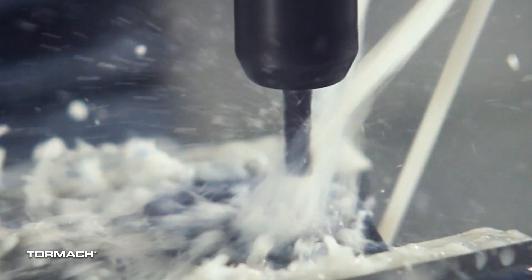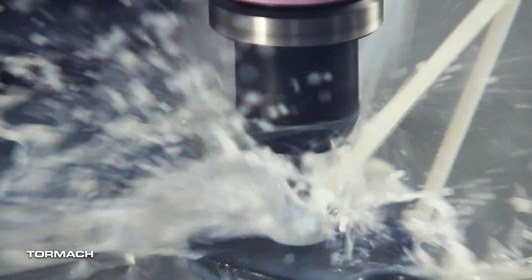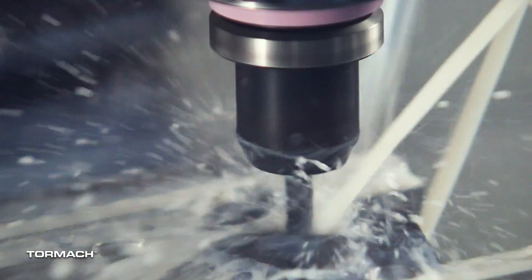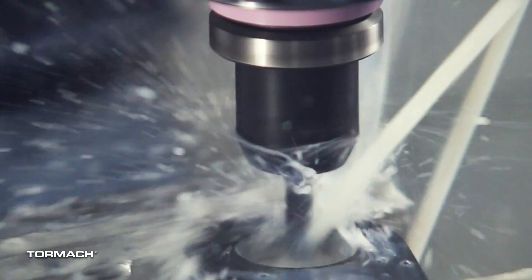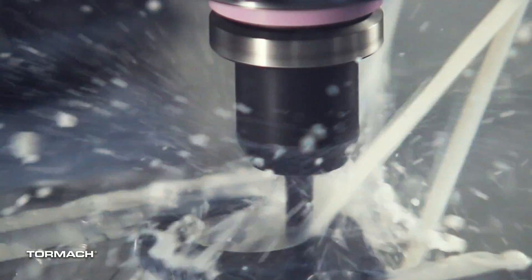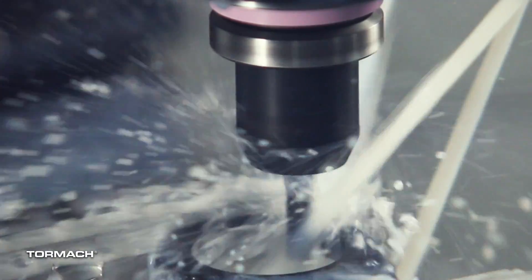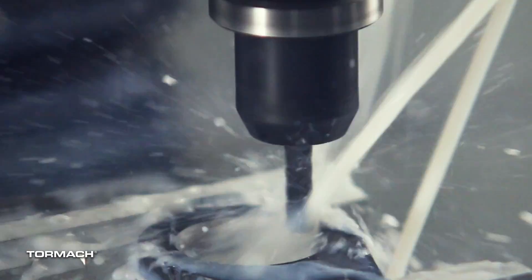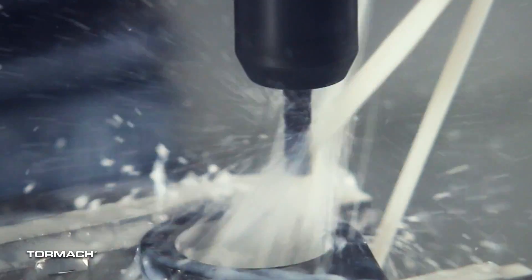This cut real nice — the cut quality sounded good and the machine just handled it real well. When we got to the larger diameter bore, I had to slow the feed rate down a little bit. The part was a little unsupported and getting a little long, so I did pick up a little bit of chatter on my initial part. So I slowed the spindle speed down to about 6,850 RPM and just maintained the same chip load I had before — that puts me at about a 60 inch a minute feed rate. We helically bore into the center of this and then do a 2D adaptive path to clear out the rest of that pocket. Then we come back right at the end with a 2D contour pass with some cutter compensation enabled to just size that bore in.